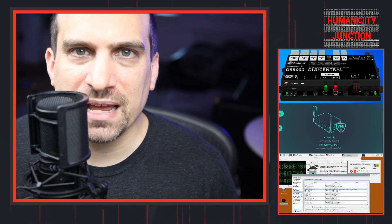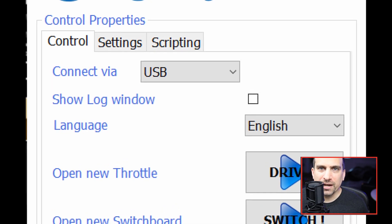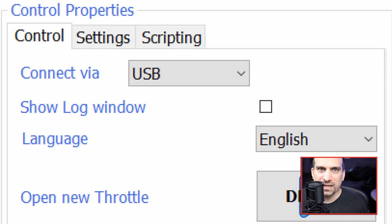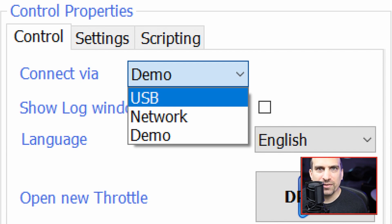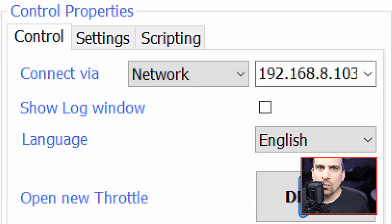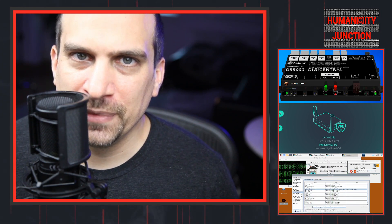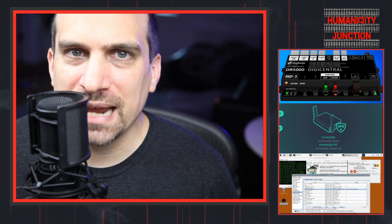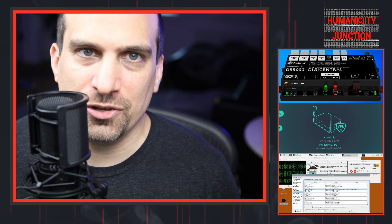Some of the main settings can be found in the DR5000 control properties. You get to these settings by clicking on the Control Start Stop button in the configuration software. It was here that I noticed the drop-down next to Connect Via that said USB. I saw that I could change this setting to Network and set the IP address. What I am trying to accomplish is to be able to connect my laptop and JMRI to the DR5000 at the same time. If the laptop can connect over the network, then I can modify the Raspberry Pi configuration to connect via USB.